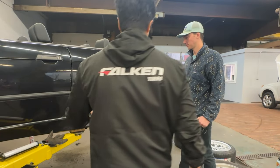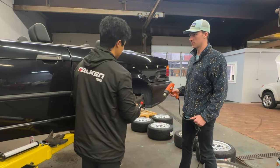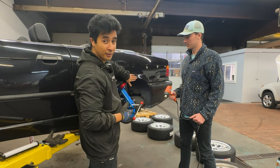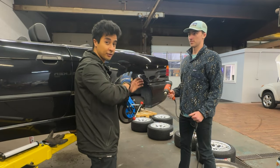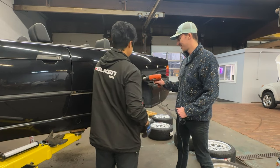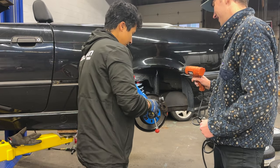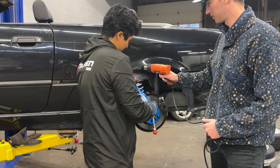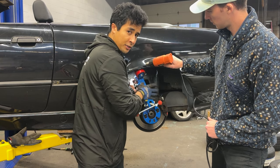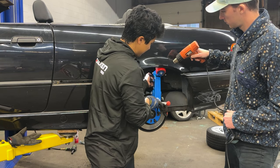Harrison and I are going to do a little tag-teaming here — he's going to keep the heat on while I go and try a pass. Usually if you're by yourself you can just blast this with heat until if you put your hand on it for a second or two and it's too hot, that means it's at the perfect temperature to start rolling. For the speed of rolling, I'd say try to cover about an inch per second — very slow with an adequate amount of pressure. This is going to be most of your adjustment happening right here, slowly pushing across, feeling the pressure without going too haywire with it.